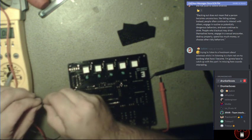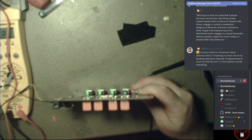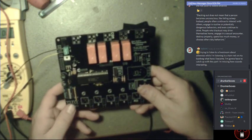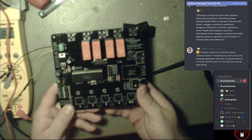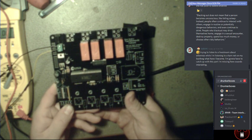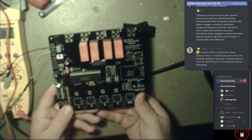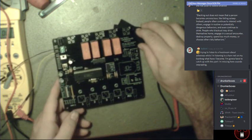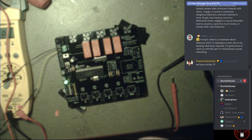You want to see some crazy? Go look up simple SDRs. Very, very basic ones. Well, I understand SDRs though, from a conceptual perspective. Right, where they're taking a block of the RF spectrum and then moving it down to audio. Yeah. That's what I do every day, talk about how you frequency down convert and then you sample it and so on. But a friend of mine had made an SDR that used a crystal and some passives, and that was it. And a sound card. For me, it's really simple to explain how a radio works by saying, oh, sure, you just mix it with an IF and then you get an output product. And I sort of just accept that all that works. How many people are like, what does any of that mean?